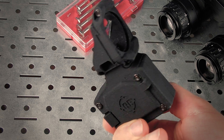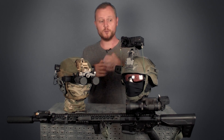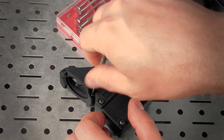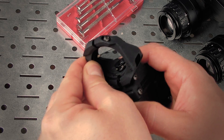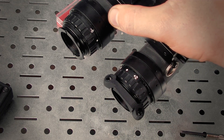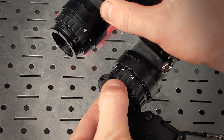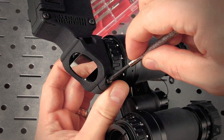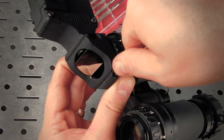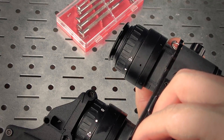When you first get the system, it's a ready-to-go out-of-the-box system. It comes with a quick-change battery and you can add an optional SD card — those are the only two things needed to make it operate. You will have to provide your own night vision goggles and the eye cup ring; links to all that are in the description. All you have to do is take the system, undo the two bolts, and separate the two main locking pieces apart — that will be the body of the camera with all the electronics, battery, lens, and mirrors, and the locking piece which goes over the top or bottom depending on how you're mounting it. Slide it on over the ring, cap it with the other half, and tighten down the bolts. This is a friction fit system, so the tighter you tighten the bolts the tighter it will stay. It naturally wants to stay in a proper horizontal orientation. You might want to keep it loose if using a PVS-14 goggle so you can quickly switch from left to right eye, but I would recommend tightening it so there are no surprises with your footage.